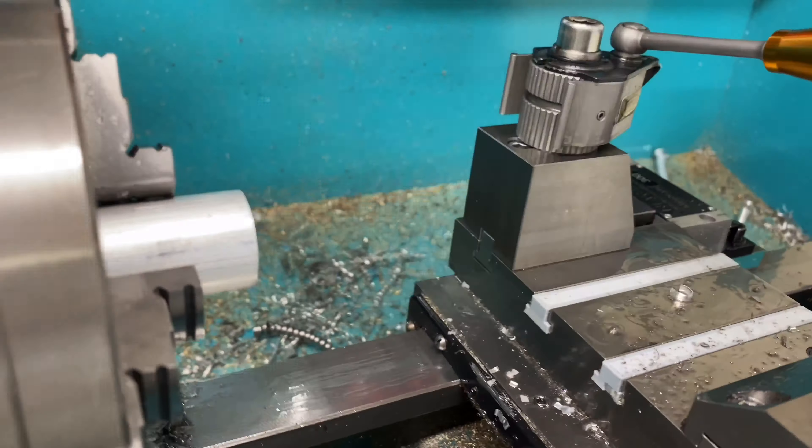It's a slide fit - a very close slide fit into the cross slide T-slot. And it's got this tenon that sticks up above the surface of the cross slide, and that is a close fit into the mount that I've made. I'll just give you a view from the other side. This space here - what I'll do with that is I'll fill that up with one of these little 3D printed packing strips, just so that I don't get crud and junk falling down in there.